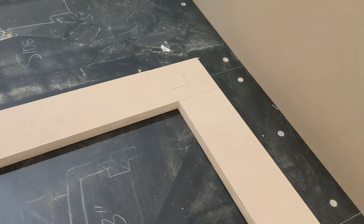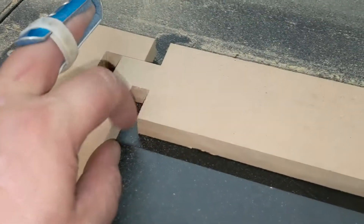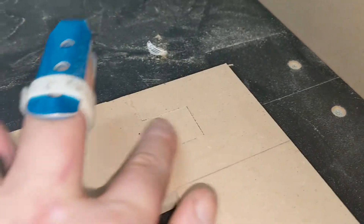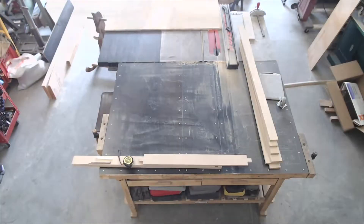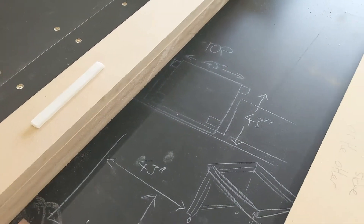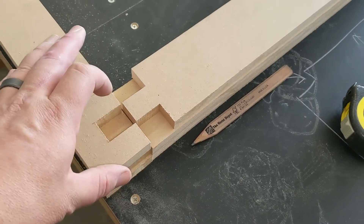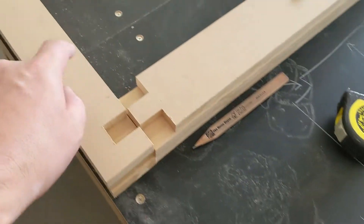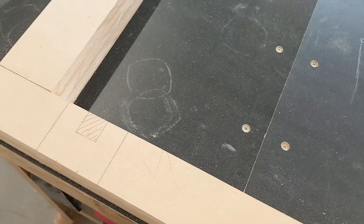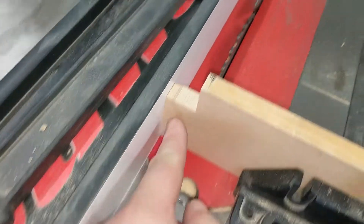I've put together one side panel — you can see the mortise and the tenon I just cut on the saw, going back and forwards to make the mortise and tenon. You can see the grooves inside where the blade cut it, and here's one pushed together which is a nice tight fit, so I think the theory is going to work. I've cut the lengths for the frame — three sides here. Now I need to cut the mortises and tenons in all the pieces, but I'm going to do the halfway one first just to make sure everything works out.